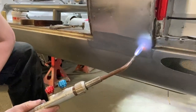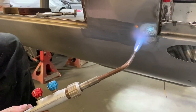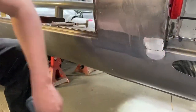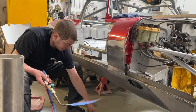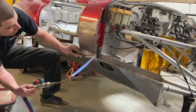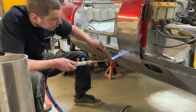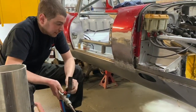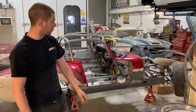You'll just heat it up and you'll see it change when you need to wipe it off. Try not to drop so much on the floor this time. I don't need too much on this joint — it's quite shallow, I like the one on the back. There we go, that'll do for that. Next step we'll file it all back down and shape it up. We've done some lead filling on the joints on the E-type, so let's let that cool down and we'll file it down.